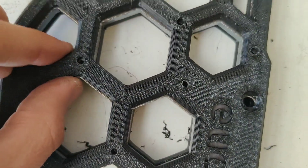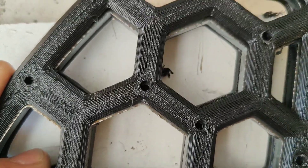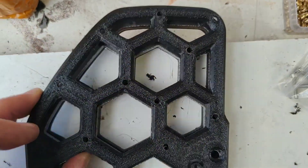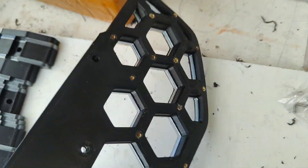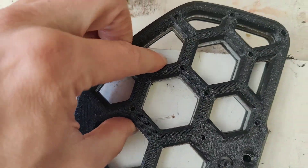I'm pretty happy, however my top plate has an issue — my printer's skew is off by about 3mm, so these top holes aren't aligning. I'm just going to have to oval them. I had big melting issues on my printer, they are now resolved. When I printed the bottom ones it was okay, but the top ones are way out and I'm not reprinting.